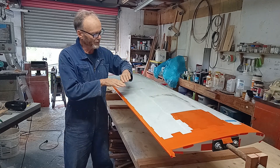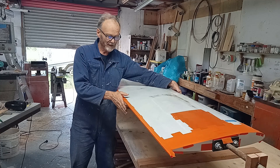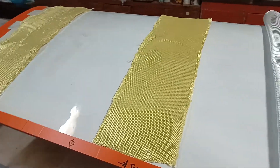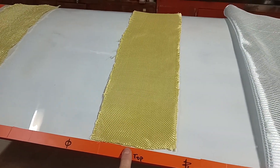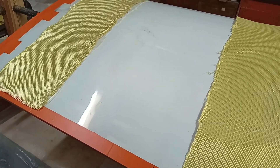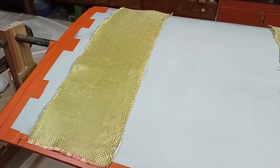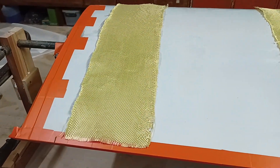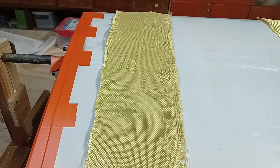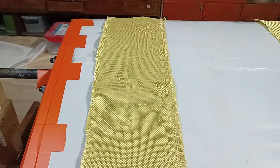My plan is to put two layers of 400-gram biaxial over it and let it drape down. When it's gone off I'll trim it. I'm putting a bit of Kevlar on top where the daggerboard will sit in its lockdown position. I'll keep away from the holes because Kevlar is a pain to trim — it gets really furry and drilling through it is terrible. Another bit goes down the bottom to add toughness where the daggerboard slides up and down through the hole — it has fantastic wear resistance of course.